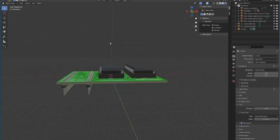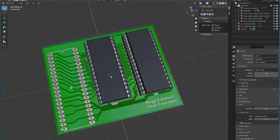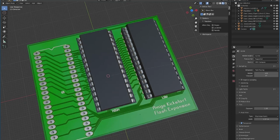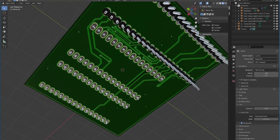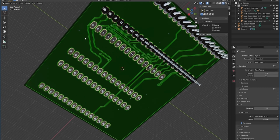And I could do one tiny modification, which is to take the A18 pin, which is, I think, the top one here, on both chips, which is currently not connected to anything, just floating because it's not connected on the 020 chips. And give that a pull-up resistor to 5 volts and a switch down to ground.